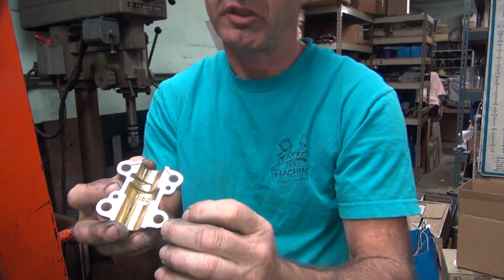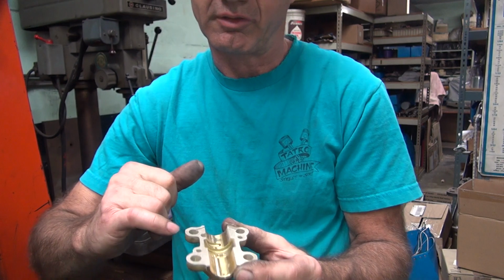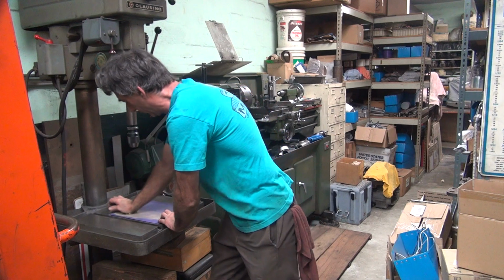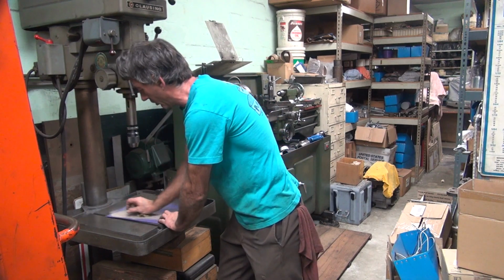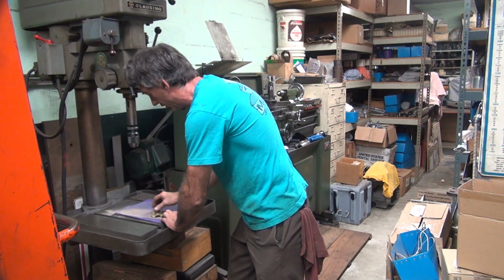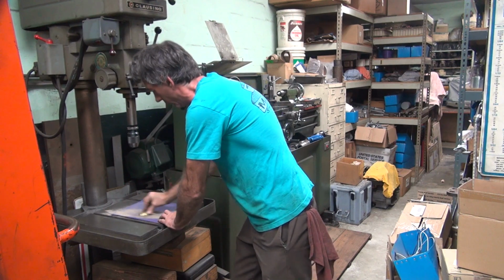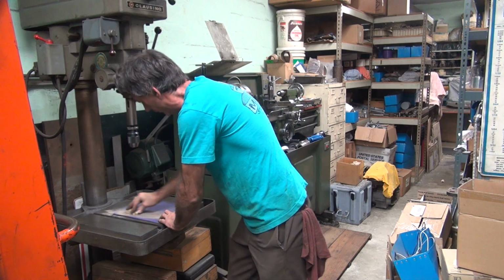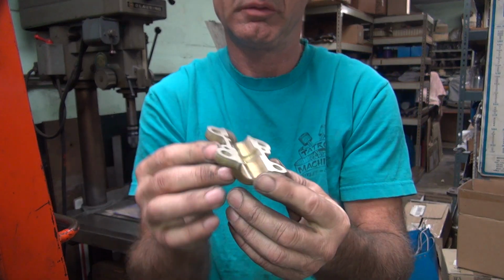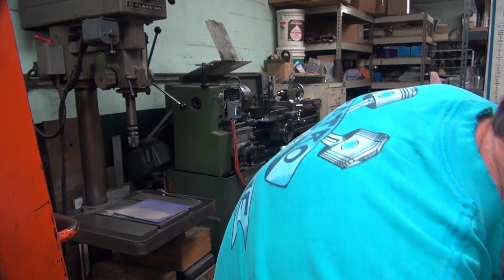See, it's almost coming in on this side. See how it's kind of dark yellow? Yeah. I mean, that hasn't been hit yet. See over here, same thing. So that means there's a twist in it. Whenever you machine something, you have built up stresses. It looks good and shiny all the way around now. Now when you finish sanding, you do light pressure, that way the stresses you're putting on by pushing on it will equalize also.